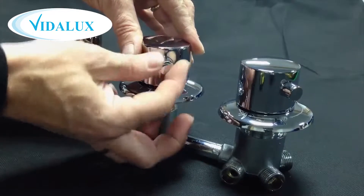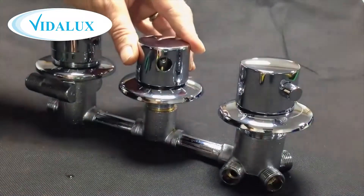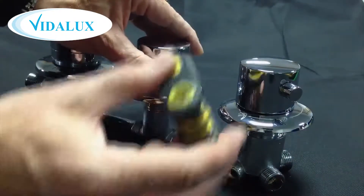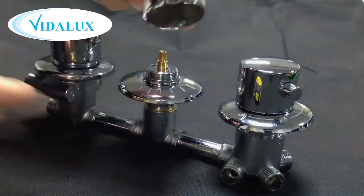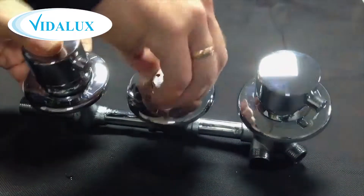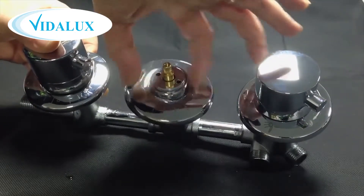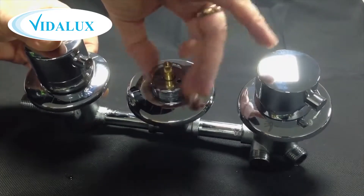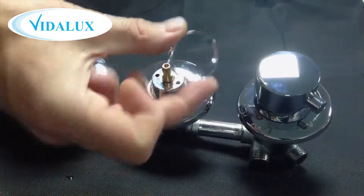On the side of the chrome dial is a little silver lug that simply unscrews. Inside we insert a two and a half millimeter allen key, give it half a turn just to loosen, and then we can pull off the chrome dial. Underneath there's a silver ring which holds on the dial plate — simply unscrew the ring and remove the dial plate.